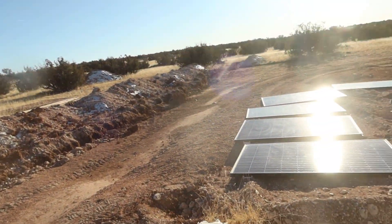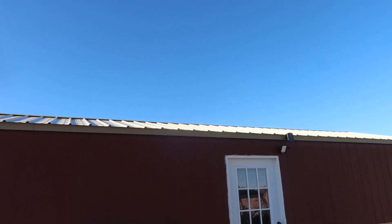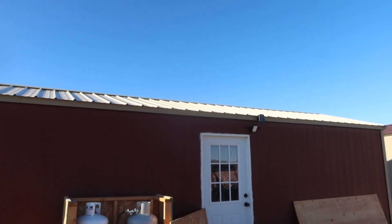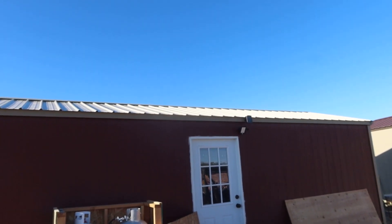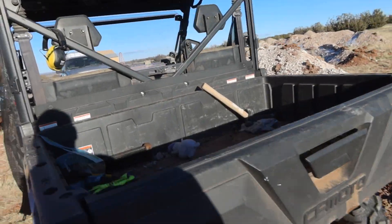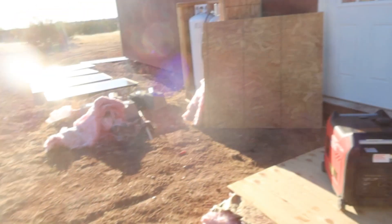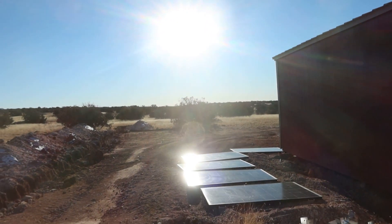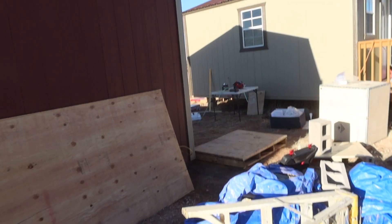So far I've got five panels ready to go. It takes 4400 watts of solar input across two strings, so that's 2200 watts per string. With my 250 watt panels, that'll be about eight to nine panels per string, so I need to order more. I want to put ten panels up there — eight or nine for the Renogy Lycan's 4400 watt total solar input. I need to get more Z brackets; I love them so far. I'll put a link in the description. I got to get those mounted on the roof — we've got a lot of stuff going on. We'll be jacking these up and I'm still going to mount the Starlink on top of the kitchen.